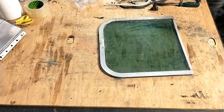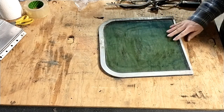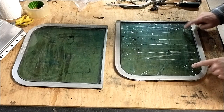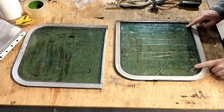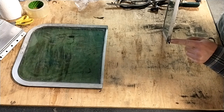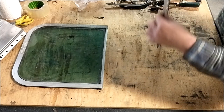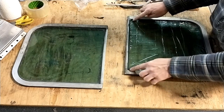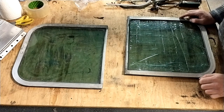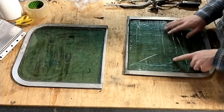Let's go back to our broken piece. We're not going to take this one apart because it's all intact and I'm going to reuse it for now. However, I do need a piece of glass to use as a template to take to a glass shop to get cut. So in the ends here are two more screws — remove those screws, then this bar here slides out the end, and then the whole glass should slide out of the frame. I'm going to pause the video, get this piece of glass out, and show you that.